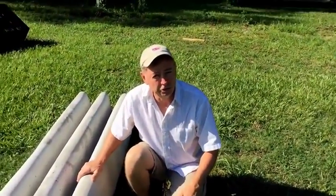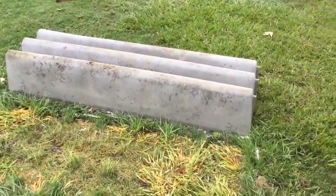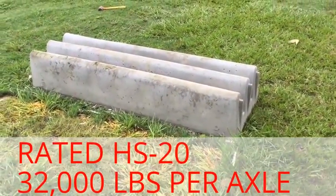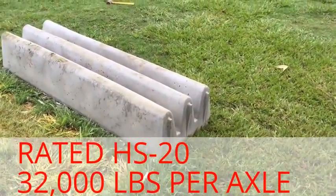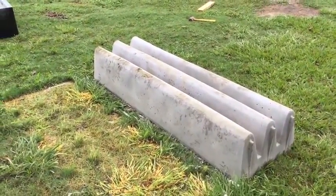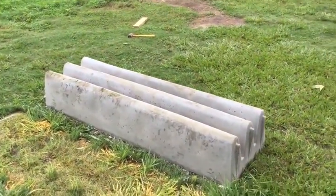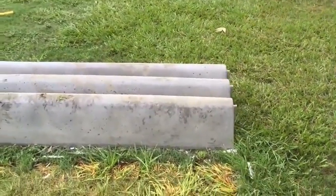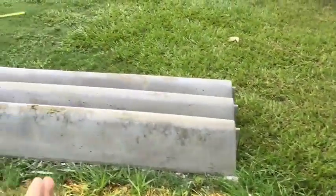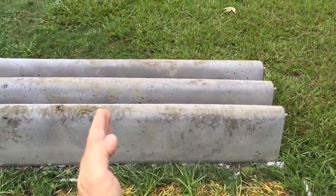What little bit of debris you do get, you can easily get it out. You've got yourself a cattle guard — this is going to last forever, maintenance-free. It has its built-in foundation. That thick area at the bottom has all got rebar in and is engineered to HS20. So as long as you keep that rebar where we tell you and pour it with 4,000-pound concrete, your vehicle tires on a six-footer paired with another six-footer will be right in the middle of your big giant trucks to hold that HS20 rating.